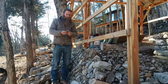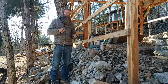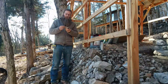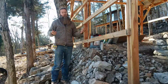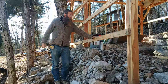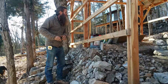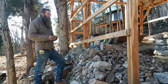The gravel is all jagged pieces picked up out of the field. Round river stones don't really work for backfill because they're round - they never gain any bearing quality, they just keep slipping and push out. But these jagged, wickedly shaped pieces actually bite and create amazing bearing. Road beds are all made out of gravel, and that's a pretty demanding situation with continuous vibration and incredible weight, so it works really good for backfill. It's free, and it's two birds with one stone - picking it out of the yard helps the grass grow and then we get to use it here. It doesn't rot, never goes away - awesome material.